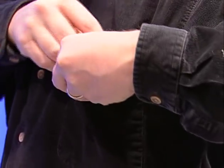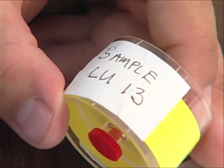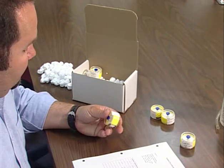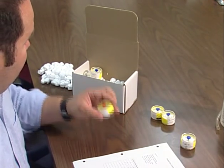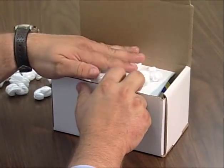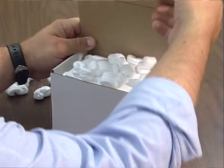The inlet and outlet plugs must not be removed. The control filter can be carried in a shirt pocket while checking the sampling process. The filter should be stored with the regular samples after sampling and sent to the laboratory along with the other filters. Cassettes are fairly rugged, however they should be handled with some care. Pack them with noodles or other packing material when you mail them to the laboratory, to help prevent any dust from being bounced off the filter during shipment.